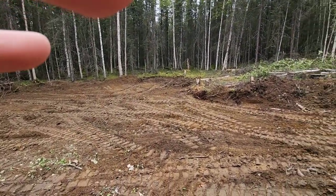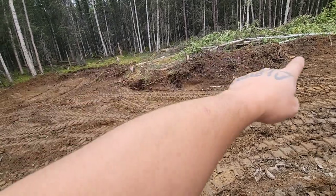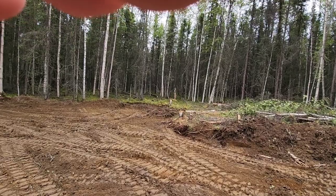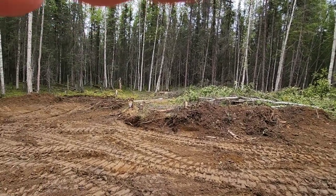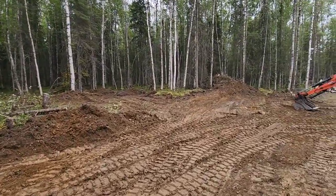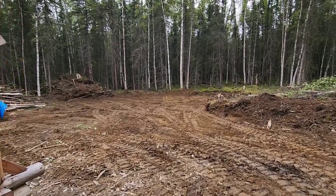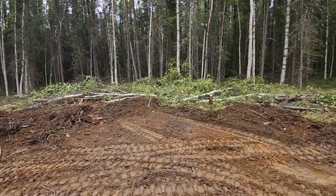And then right in this area, right in front of us here, is where I'm going to start excavating. All this brown dirt is going to go out of here into a pile. And we're going down to the gravel. And then we're going to smooth the gravel out as nice as we can, and then rent a compactor and compact it. And we'll be ready for some concrete grade action. Once we have our concrete grade set and compacted, then we're ready for the concrete itself, I should say. Concrete mixing action. That's what we get to do. And making forms. Make some forms and mix some concrete and pour them in and off we go.